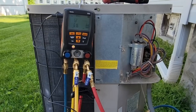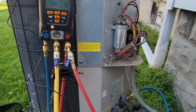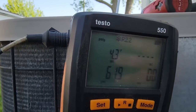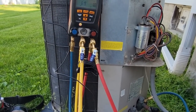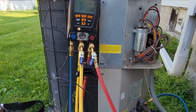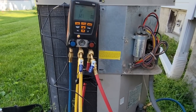These are the videos where I'm working on equipment and people get judgmental — but you don't know the back stories. We're all the way down to 4 degrees superheat — it's overcharged. I'm not going to redo the duct work, I'm not going to go through static pressure. Sometimes you just can't do all that if people don't want to pay the money. You just get it running and get out the door.